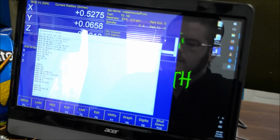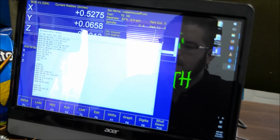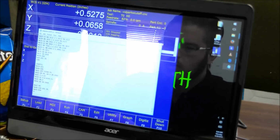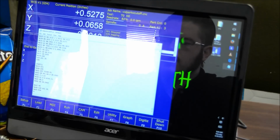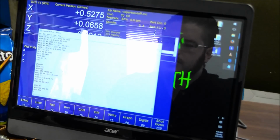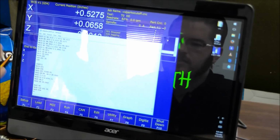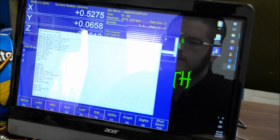Now, one thing more that has to be added, and this has to be added to any tools: your lathe post processor code is not going to have any Y coordinates. Well, when you change work coordinate system locations, you are going to want to zero that Y. You could choose if you want to make a separate line just to do that. I simply add it into the rapid movement as it rapids towards the beginning of the location before the tool path. I just enter right in there a Y0, and what that will do is center the Y axis for that work coordinate system location.